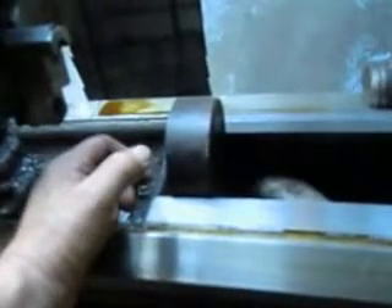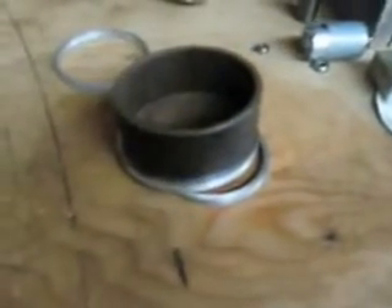I found a piece of metal — it's the bottom of some sort of little tank. The bottom plate is pretty thin, so I think what I'm going to do is go ahead and chuck it up on the lathe and trim that bottom off, kind of open it up, and then do what I did with that other one: put some supports in there and a centerpiece, and we'll be able to use that as our forming tool to give ourselves another quarter inch of diameter.